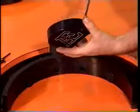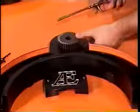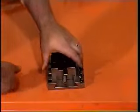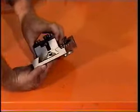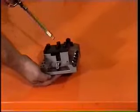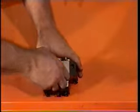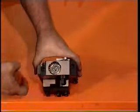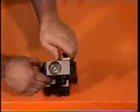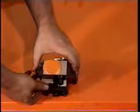The motor mount cover should be removed so that foreign debris can be removed from the drive gear. The tool slide should be free of debris in the dovetail section in front and rear of the tool holder and inspected for wear. End cap of the tool slide gearbox should be removed and inspected for debris. Star wheel should be rotated while inspecting the gear to ensure that components are functioning properly. A light coat of grease can be applied to the worm gear.